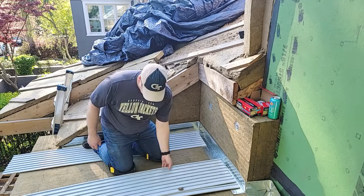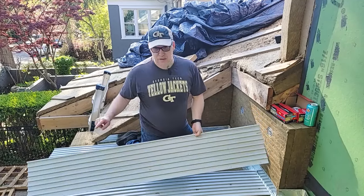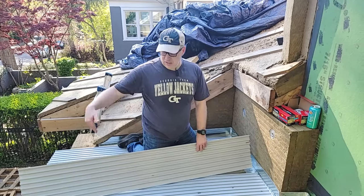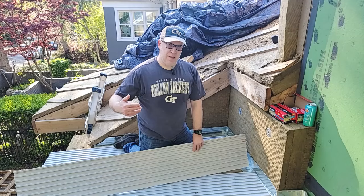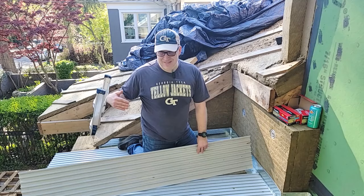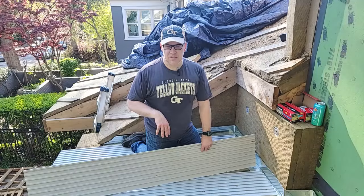I've got the TI Pro Board and we went ahead and cut these a little bit long. I added two inches for insulation that's going to go all around the outside — that's going to be the Comfort Board 80 right on the nose. We're putting two inches, we're going to have a three-quarter inch furring strip, the bug screen at the bottom, and then five-quarter board which is one inch thick. So we basically cut these exactly three and three-quarters inches too long so we can go ahead and put the siding on the edge once this is installed.